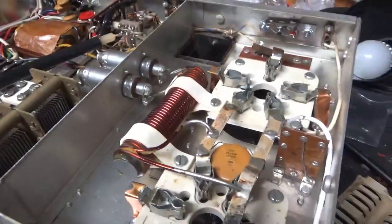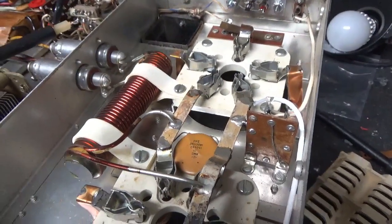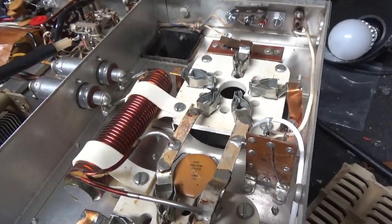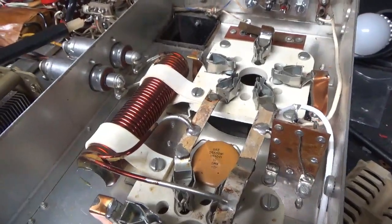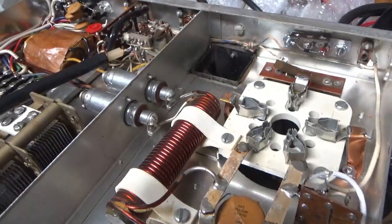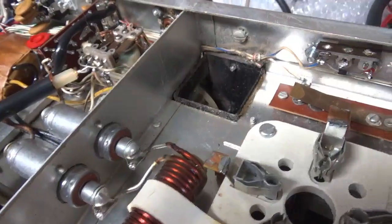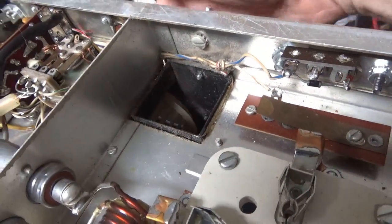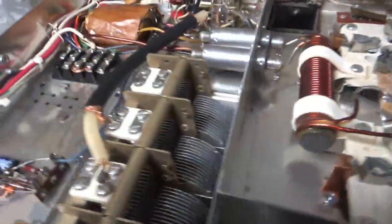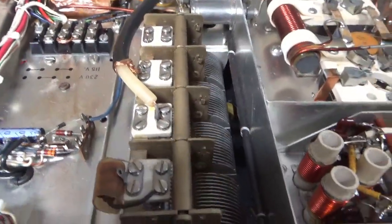I told the customer to make sure the impeller spins freely. I left the cardboard on until the very end, and when I took it off and spun it, it was rubbing — not great. But I got lucky: I was able to loosen the Allen screw, pulled the impeller out just a hair, and it's no longer rubbing against the scroll cage wall.